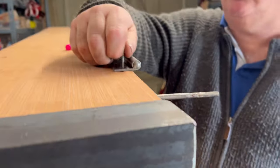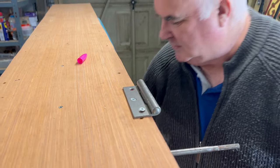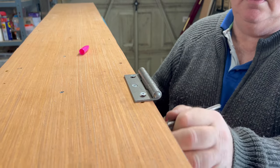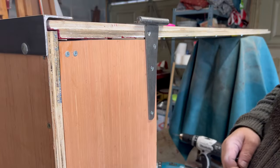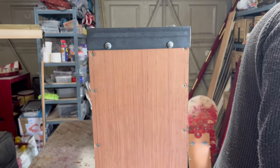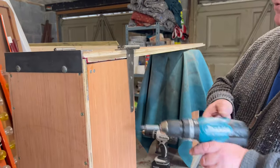Take your hands off — these screws are quite sharp. Some of those aren't as flush as the middle one. I'm going to take them all out again in a minute because what we do — we split the hinges. We grind and cut them, we put pins through them. I'll show you in a minute. I'll just unscrew this and then I'll show you.